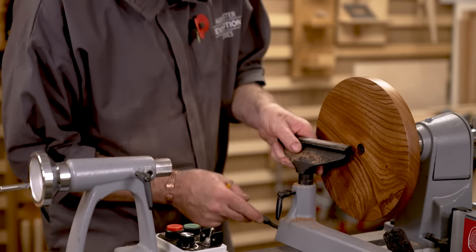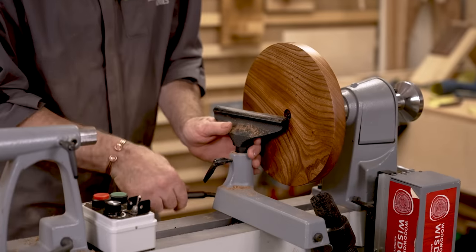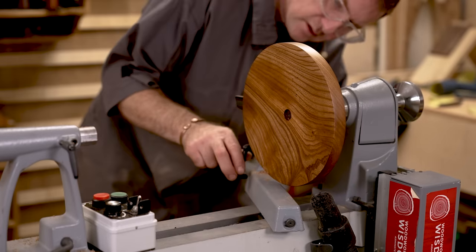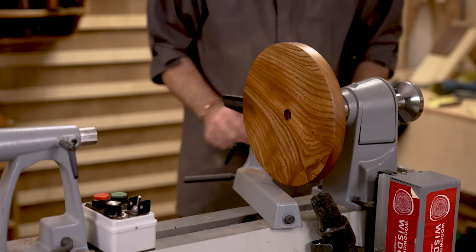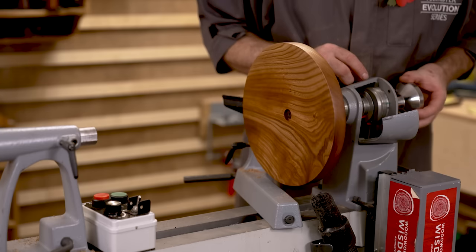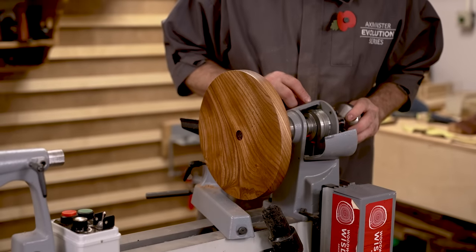Now, first thing I probably want to do, let's get my tool rest set up just to a centre height. That's not bad. Now, I've got to be careful because I've got to bring it round. So I've looked at my height there. I can double check off the back. The lathe on here, we've got a bit of indexing, so I can open this up. I can see where I want to be. Let's come round, let's go to zero, so that's there.